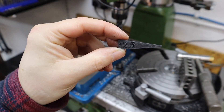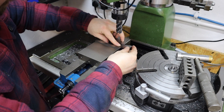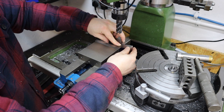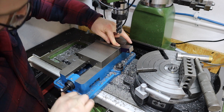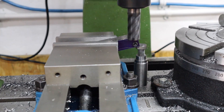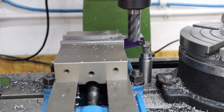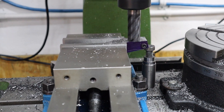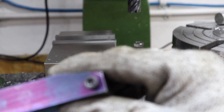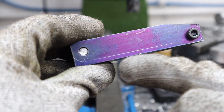Using the 3D printer again, I've 3D printed some angled blocks that I can stick under the workpiece, which will allow me to machine down to the lines I've marked. The good thing about this build is these lines don't have to be super accurate, so a 3D printed angled block is going to work perfectly here. With that first angled piece all machined out and pretty close to those scribe lines, I'm going to work on machining out this bottom section.